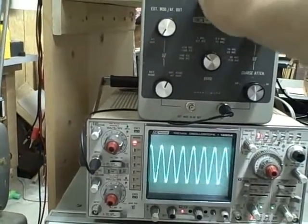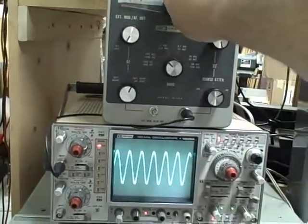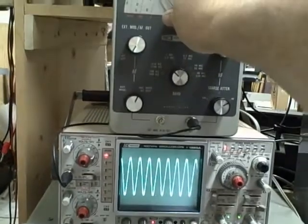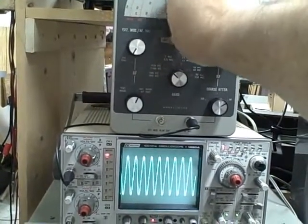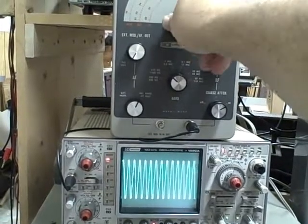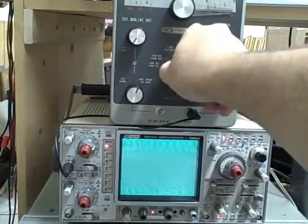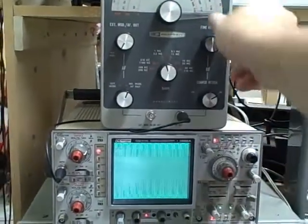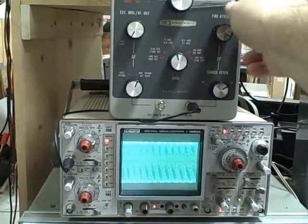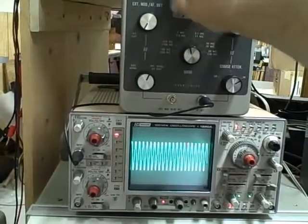What you want to look for is any oddities in the waveform that would be objectionable in aligning your equipment. Let's get ourselves back down to the low end. We are now on band B, covering 310 kilocycles to 1.1 megacycles, and we'll slowly raise it here, observing the waveform. Here we are greatly more efficient, so we're going to lower down the amplitude using the attenuator.